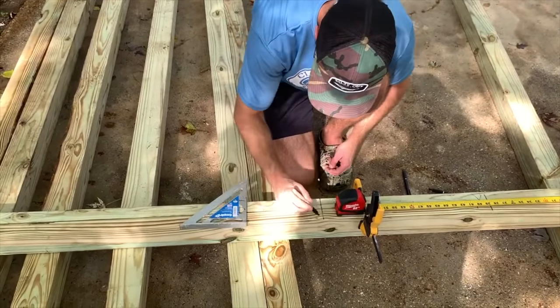Cut approximately 4 inches off the first piece of starter strip so that the joints between the shingle course above and the starter strip don't line up. Position the first starter strip in place so that it overlaps the rake drip edge by around 1/4 inch and also overlaps the eave drip edge by 1/4 inch. After positioning the starter strip with an appropriate overhang, secure it in place with 4 nails. Then install the next piece of starter strip, ensuring that you have the correct overhang, and then using 4 nails to hold it in place.